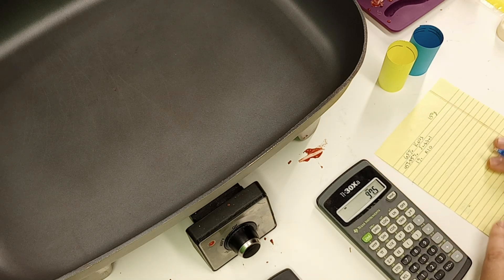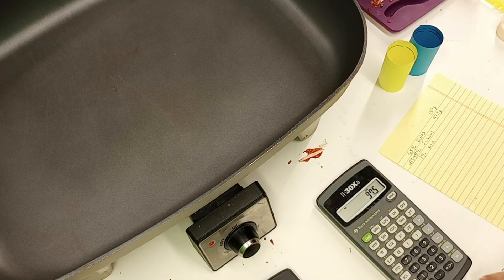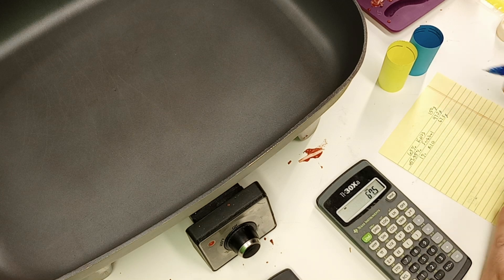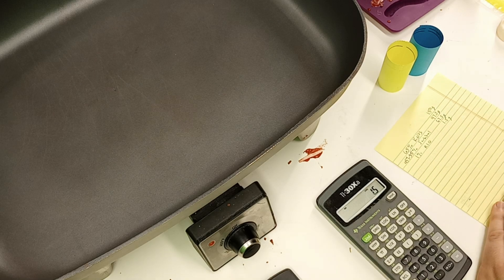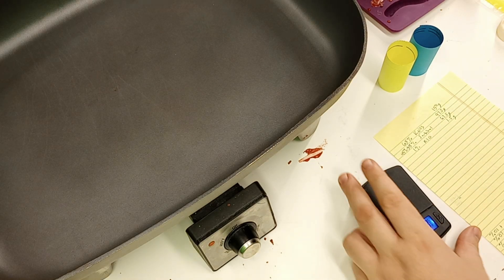In order to get the right amount of propellant, we need about 150 grams — each grain is about 70 grams, so that gives us about 150 grams total. Then just calculating the percentages of the different components, I can calculate the number of grams of each component we're going to need. And keep in mind, we're adding 10% extra sorbitol to this mixture.